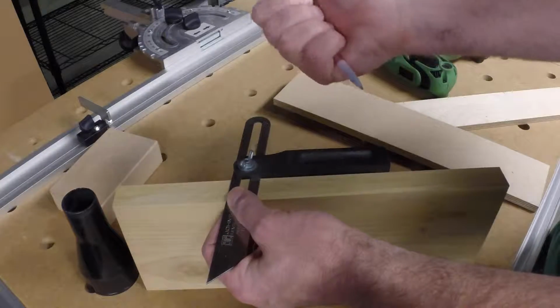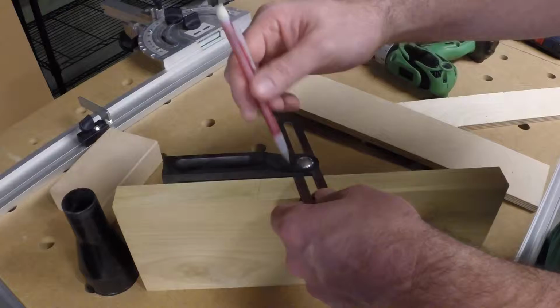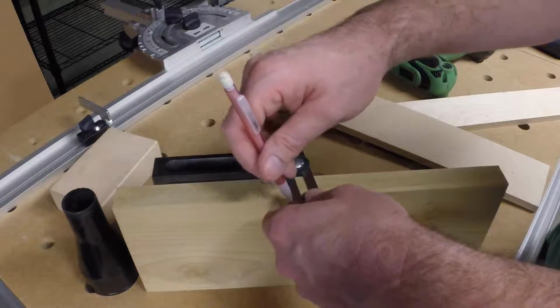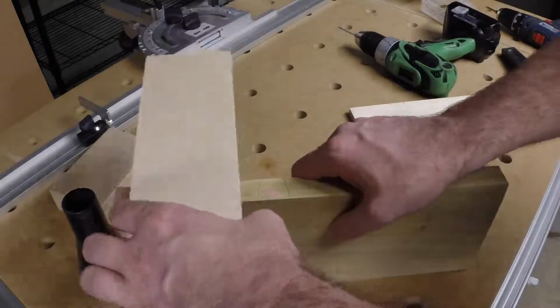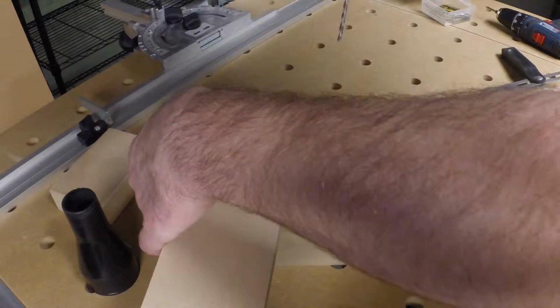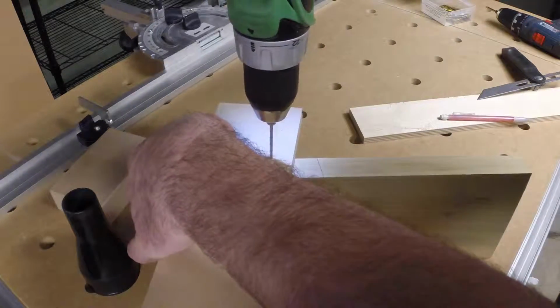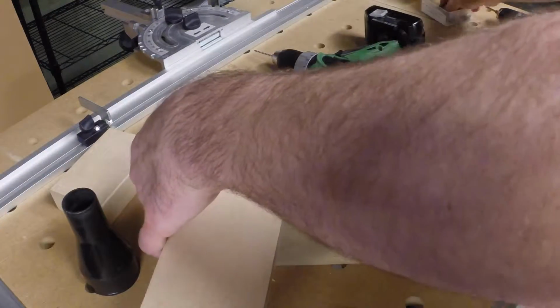These dovetails will use a 1:6 ratio, so I'm transferring this angle to the backer board. The distance between these 2 lines is arbitrary. You can make them the size of your tails, or you can make them a little bit bigger or smaller and then slide the jig back and forth to hog out the area. You'll see when we start making them.